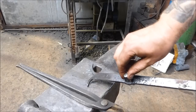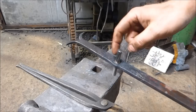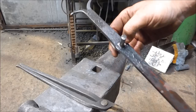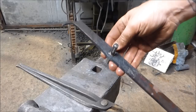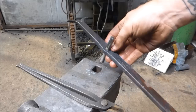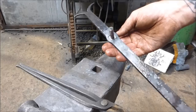I just quenched it off and it's in there. It's at 90 degrees. I think if I give this a tap with a hammer it's going to come out. If you wanted to, you could weld this in — you could even get this all hot and fire weld that together. I don't think that's going anywhere, and once it's all riveted together it's not going to budge at all. So I'm just going to leave it as that.